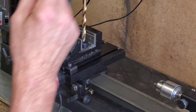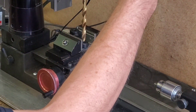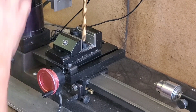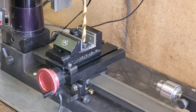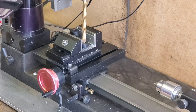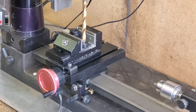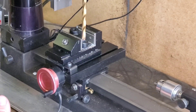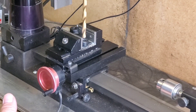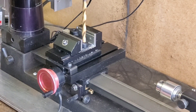I'm going to turn on our dial indicator and zero it out — that just lets me know we're staying in the same spot. We've got about 400 RPM, which is not very fast but appropriate for what we're going to do. We're going to come in here and see how it looks. You're going to hear it's definitely not on center and hitting unevenly because we're dealing with this odd oblong hole that's been messed up already. Looks like we're getting it pretty good all the way around, picking up all of the oblong hole.